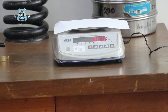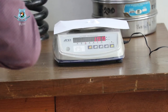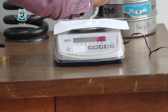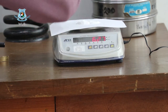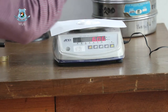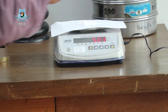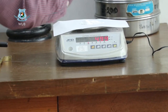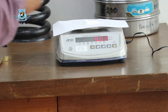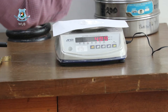The name of this chemical is sodium hexametaphosphate, and we have to take 10 percent of the total soil weight — that means 5 grams, since we took 50 grams of soil sample. This is 5 grams of the chemical. Now we have to mix this chemical with the soil into the water.